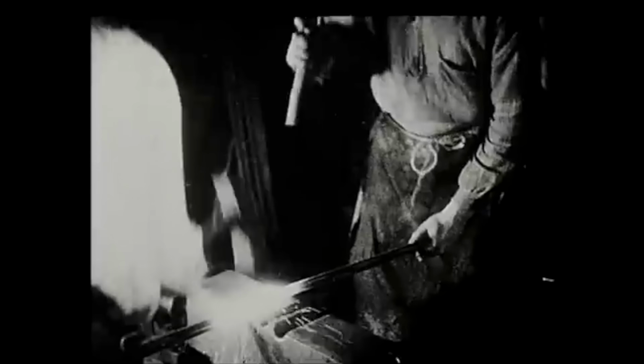Because this could be even bigger than the titanium rabbit hole in terms of all the things that we could do to experiment with this technique. Now the good thing they've got going for them is they're using a coal fire, which means they can get way more controlled heats in terms of heating localized areas. That's what's going to be hard with the gas forge. In the gas forge, you have to go into this pipe, but in the coal fire, you can kind of come from above and pop it in and then lift it straight out. So we might have to break out the coal forge again.